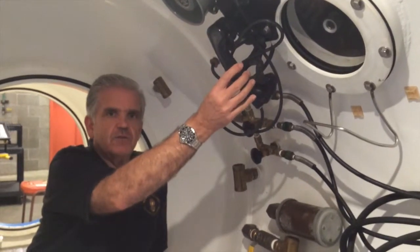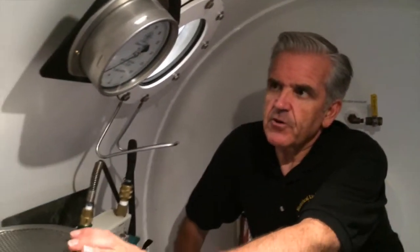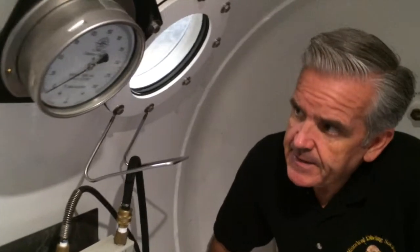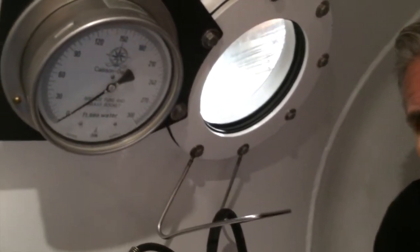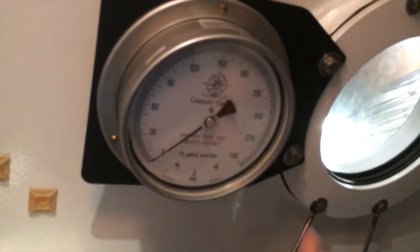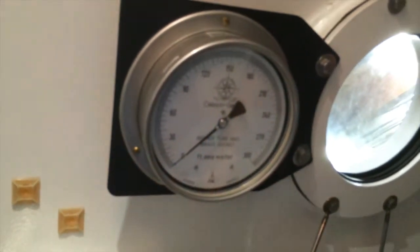These here are rarely used during a normal operation, but you may see these offshore. As far as other components go, we have our internal caisson gauge here, calibrated in feet of seawater. That is going to give us an approximate depth of where we're at. The final calibrated depth gauge is on the outside, but this is usually plus or minus two feet. There's your caisson gauge — it's open at the back, so it simply senses the pressure.